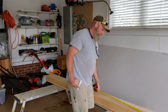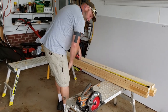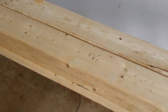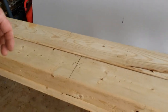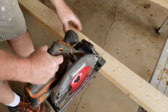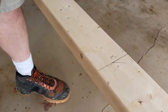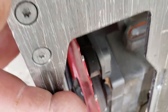Alright, 40 inches is our one board. When I do that I have to make a mark - make a crow's foot - and put a little X on the side, because that's the side of the line I want to take. With rough framing I'm not really worried about it so much. The X is the side where I'll run my blade down that side of the line instead of right down the line.